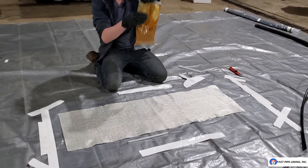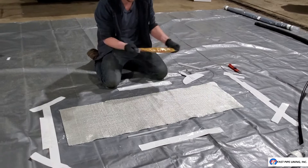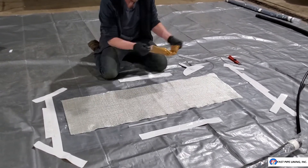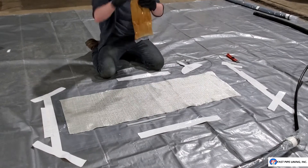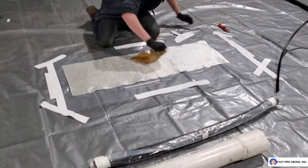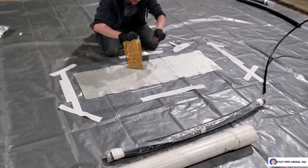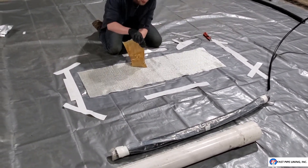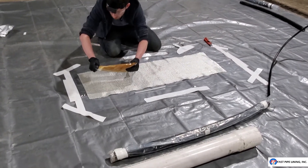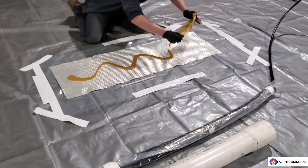On the corners it tends to gum up, so make sure that you get that resin out of the corners and it thoroughly mixes. Once it has reached a nice caramel color, you are ready to proceed. Grab a knife and cut a small hole in the top — do not cut the whole bag open as it will pour everywhere and you will lose your resin. Pour half of your resin on the lace side; remember to start on the lace side.